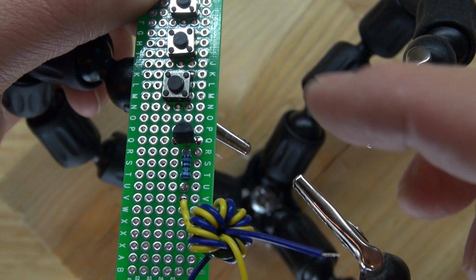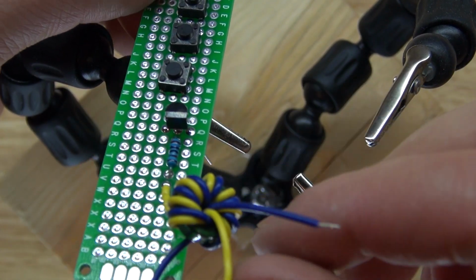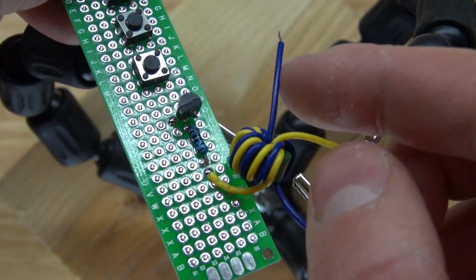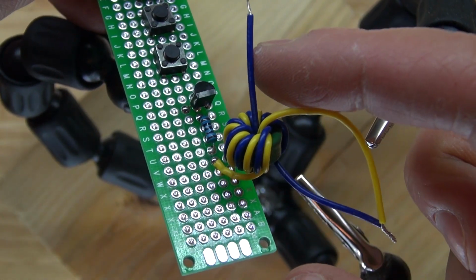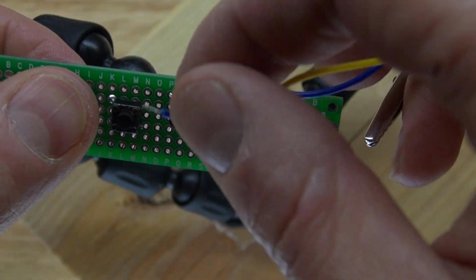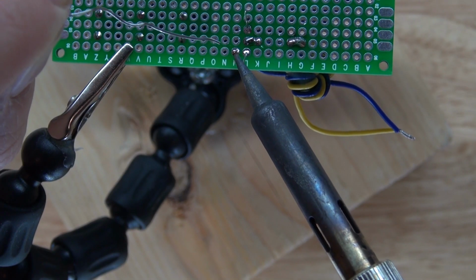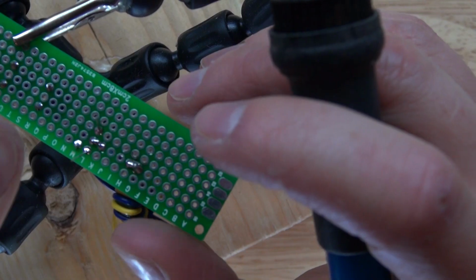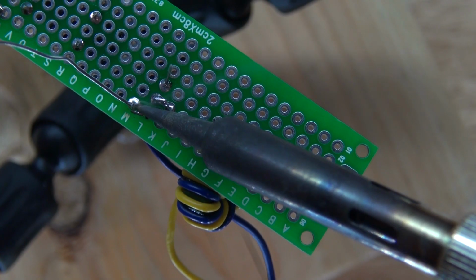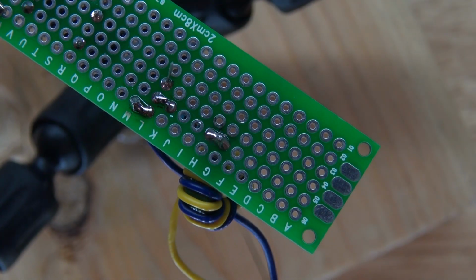And now what I want to do is connect the emitter of my transistor to the second wire of the inductor, the wire that's on the other side of my inductor. Place it over just like that. Solder it into place. Snip the excess, fold it over, and then form an electrical bridge. There we go.